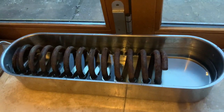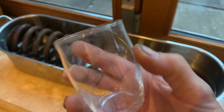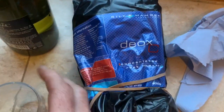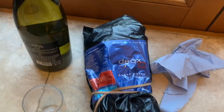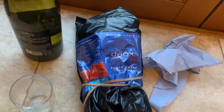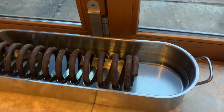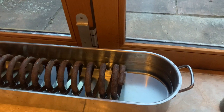We're going to leave this spring in a rust bath for a couple of days to see if we can get all of that rust off. That rust bath consists of two small glasses of Bilt Hamber Deox-C crystals — we buy this in a five kilogram bag, it's about 40 pounds, but that bag lasts an awful long way. So two small glasses of the crystals and 38 glasses of hot water, and then we're just going to leave that in there.